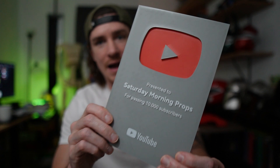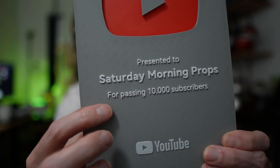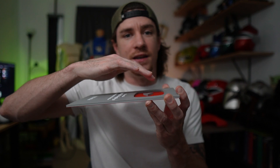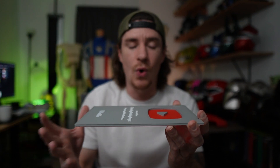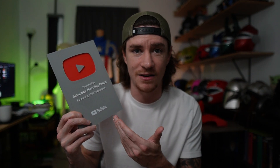Back in the day I would either have to sand and paint this — take a little brush to paint all the little white spots — or I would have to manually be there when the print stopped at the 20th layer line, then go swap it to the gray filament, wait till it got to layer 110, and have to manipulate G-code. You don't have to do that. You can paint that in the slicer.